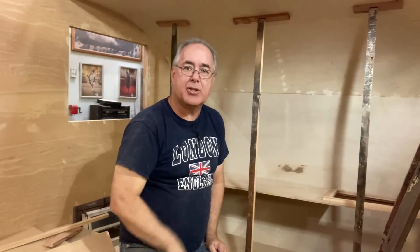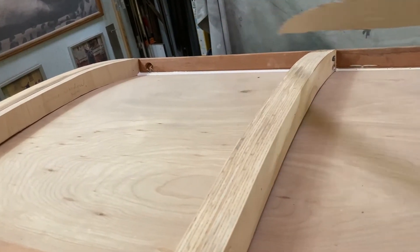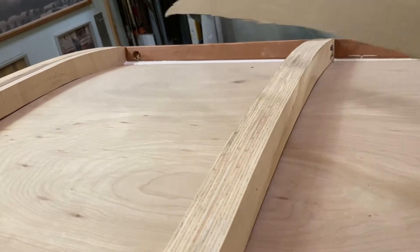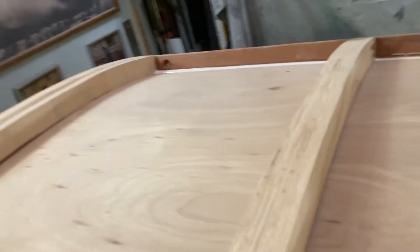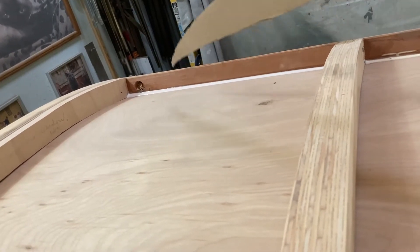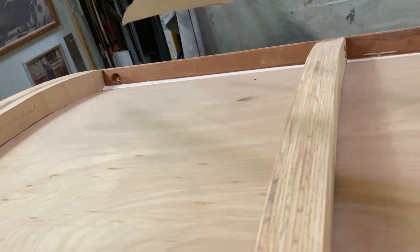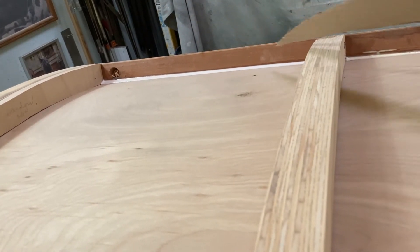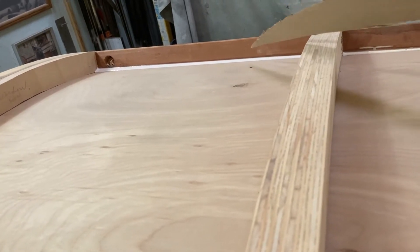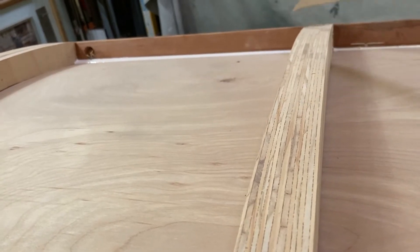Let's go up to the top of the trailer and I'll show you. Here at the top of our trailer we have our spars that go along here and our beams. What we are doing with our braces below is pushing our ceiling up against this spar, and then I run a bead of thick glue through here so that it can run underneath that spar and the wood will attach to this. It's a lot of information just to say you're gluing the ceiling to the top beams.